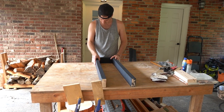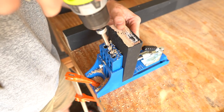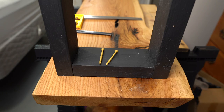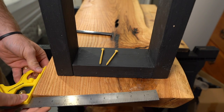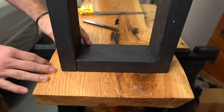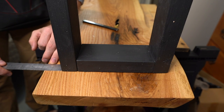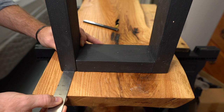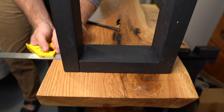Wrapping up the legs — I decided about seven inches between both legs on each side would be plenty of space. Here I'm using my Kreg pocket hole system to drill pocket holes and get the cross brace secured to the legs — that's the top side that will sit up against the live edge slab. From here, we're going to attach the legs to the backside of the live edge slab. I decided both sets of legs should be inset from the edges about three inches, and measured about an inch and five-eighths from the backside as my reference point since that was the most straight.